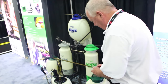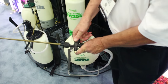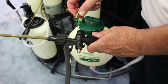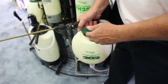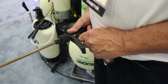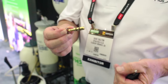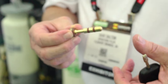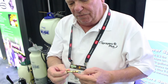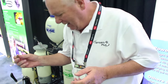As we move down, this is a very important piece — your spindle. In all except our 300 series entry level, we use brass with two O-rings. When you start squeezing the trigger and it becomes very stiff, rather than overpowering it, pull this piece out and put a very light coating of the silicone we provided on the O-rings. Your trigger will be working like brand new again — it just means it's dry.